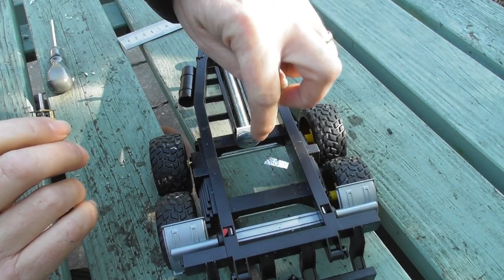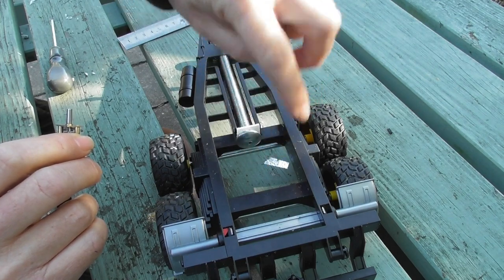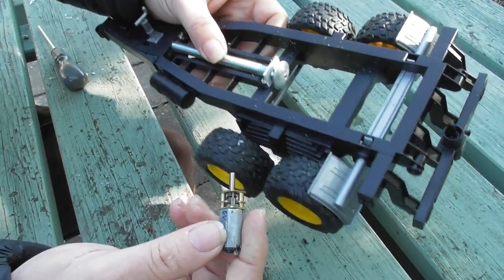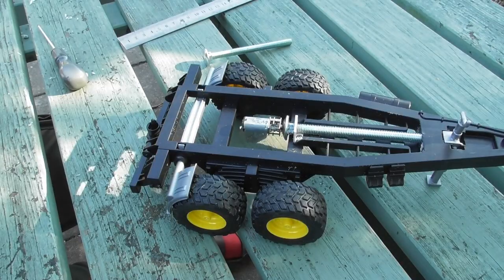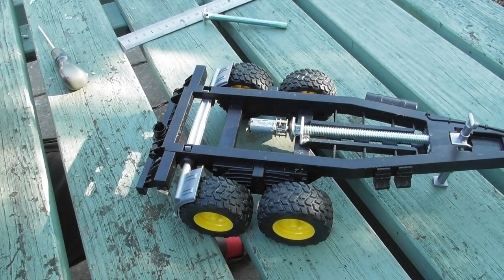The coach bolt was drilled with the 3mm bit using the lathe to centre it, as I did with the first one, and tapped and a grub screw put in there. So this also fits in really nicely. The next thing which I need to think about is a way of mounting this so that it remains still and that nothing's under any strain.